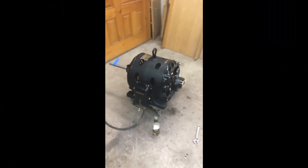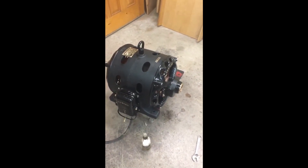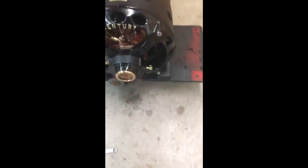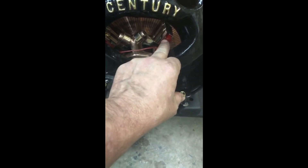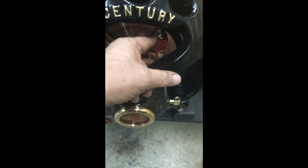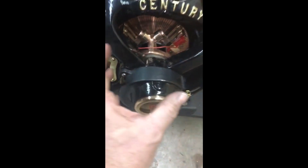Well, you know what the open beer means — it was successful. So I thought I'd go over everything that had to be done on this motor. First of all, I didn't even know if it would run, so I had to put it together to see. There weren't any brushes, so I made those brushes. Of course, there were also parts missing — the brush holders, the little gibbs screws, this whole brass apparatus and pointer.